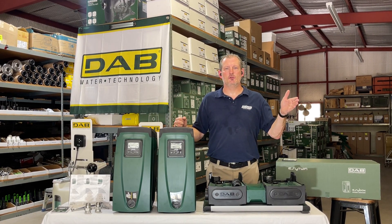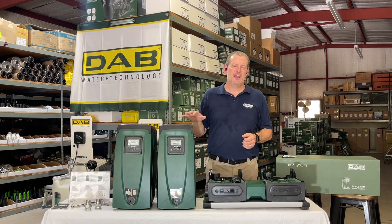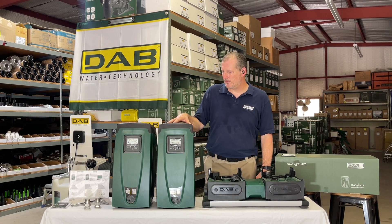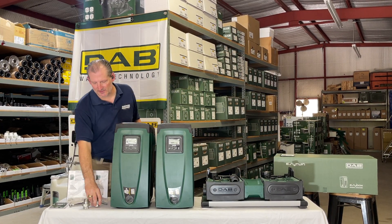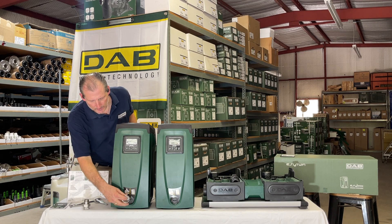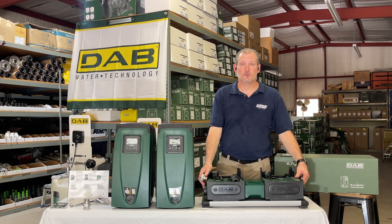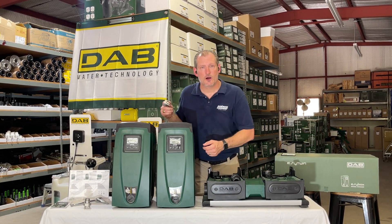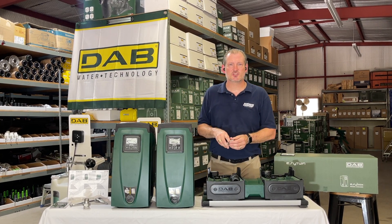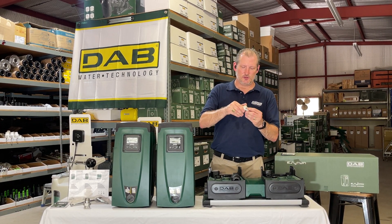It's going to allow you to use less electricity. At 230 volt they use about half the amperage of a 110 volt pump, and you can't really find a 110 volt pump anyway that will produce the kind of flow and pressure that these Easy Box systems will produce. They do come with stainless steel union connections in one inch, and it's very easy to make your connection. Your inlets are on the front, your outlets on the side unless you're using the docking system — in that case your inlets and outlets will be on the side with no connections needed on the front.